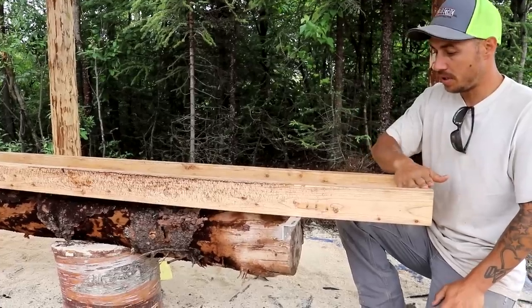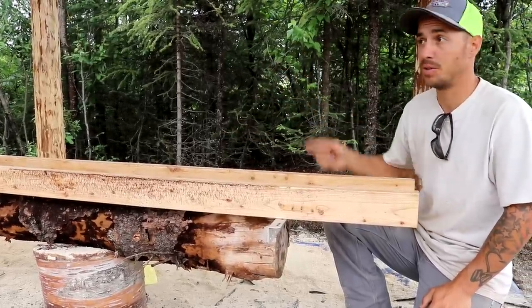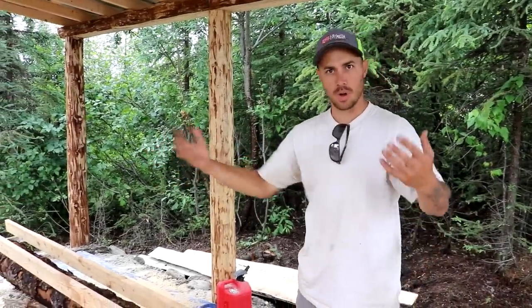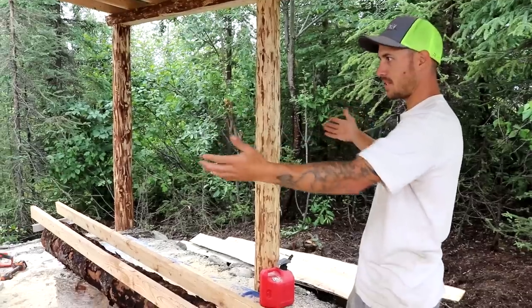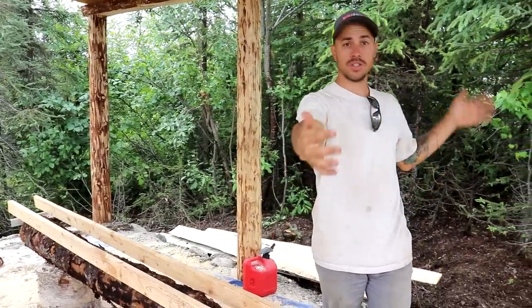We're gonna set the saw up on here, and we're gonna get this first cut down, and then we're gonna just keep cutting out planks for the walls. And the plan for all the walls on this thing is that this whole thing is gonna be enclosed except for that front section where you're gonna walk in. And not only is it gonna keep the snow and the rain out of here, but it's also what the wood is gonna be stacked up against. Every single wall, except for the two end walls, is gonna be 8 feet. The two end walls are 10 feet apart.